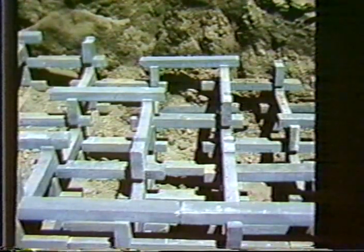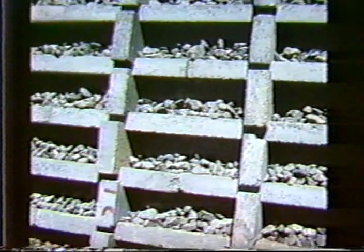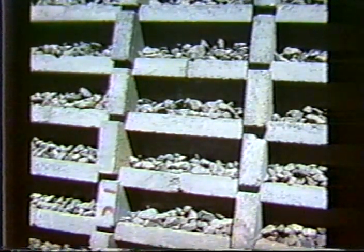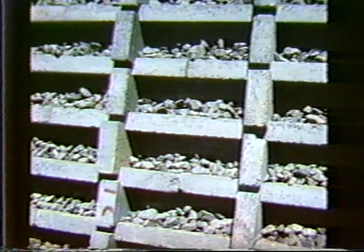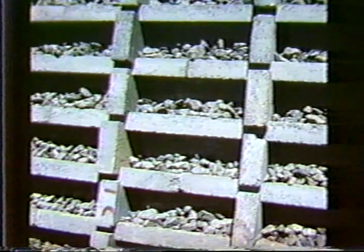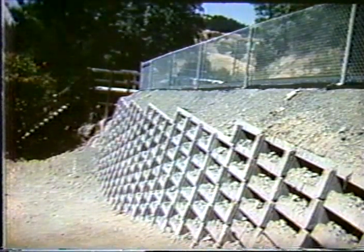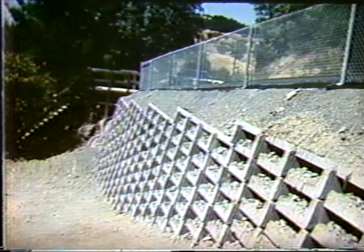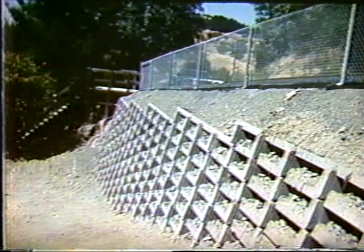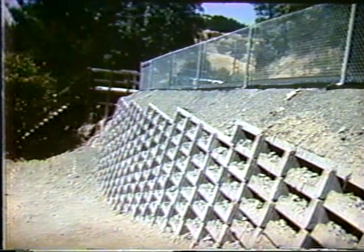It's just like Lego type of construction. Of course, if you backfill one of these walls using this granular backfill, you're not going to get a whole lot of vegetation growing on it. So there is that aspect of using the different types of backfill with this crib block wall. Here is the completed wall of that site, and I suspect it's going to stay looking like that until some vines grow up from the bottom or from the top. Not a whole lot will be growing on the face itself.